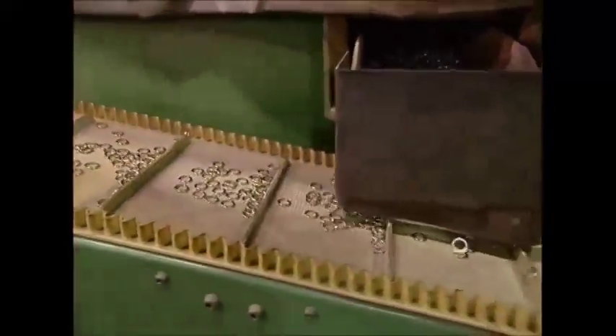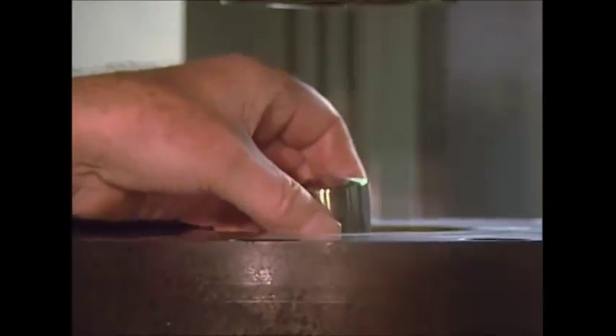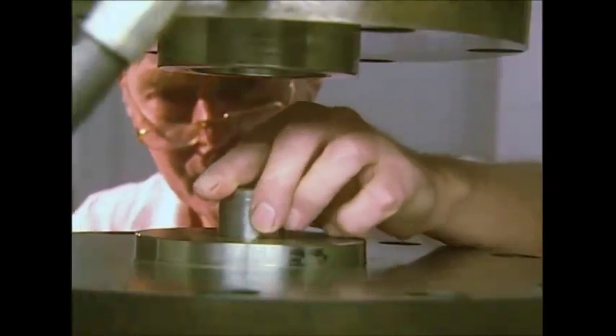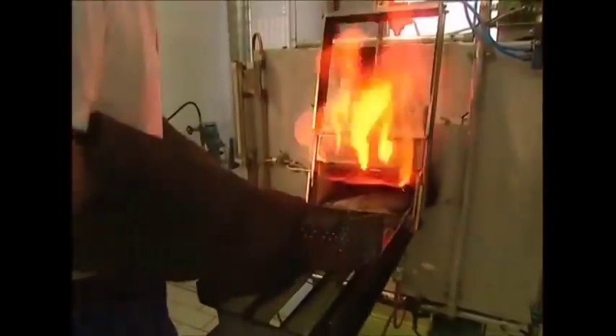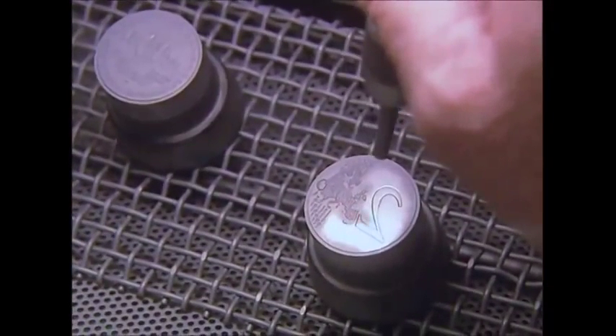So we've got our outer rings and we've already made up the fillings, but there's still something missing — all of our pieces are blank bits of metal, and a template is needed to turn them into coins. The engraver's job is to make the coin equivalent of a rubber stamp. Using an industrial press, he crushes a pattern onto the stamp block, exerting 160 tons of pressure, so he's got to be very careful. The stamps are hardened in a furnace at 870 degrees Celsius. Without this treatment the motif would disappear very quickly, but once it's been hardened, each stamp can engrave as many as 200,000 coins. The surfaces are scraped clean using fine glass to remove any imperfections, then checked and polished before being put to work.